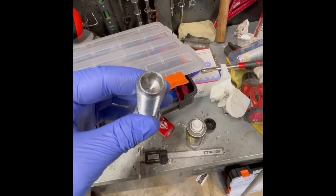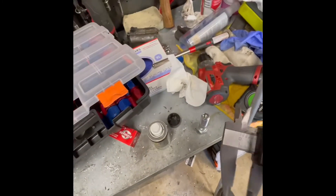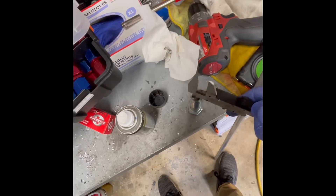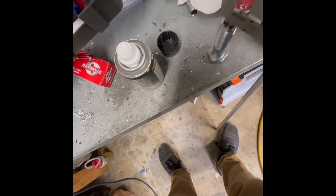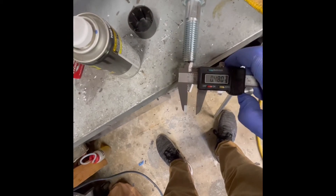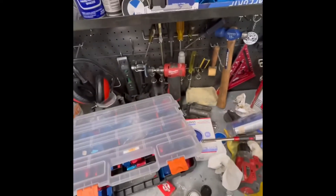If you can see - pretty good, nice and clean. Now what I'm gonna do is measure the inside. It's 0.48 inches. And then I have this solid rod right here - this solid rod is about 0.6, so I'm just gonna bring that down and push it in. Simple as that.